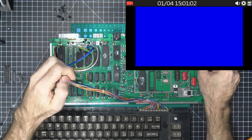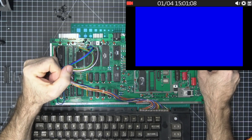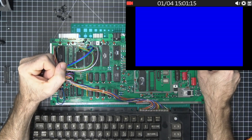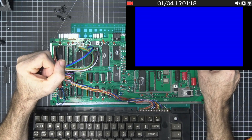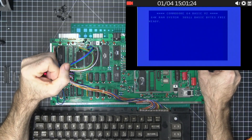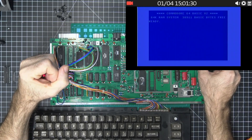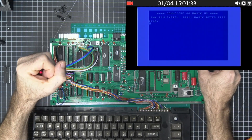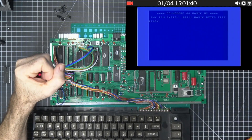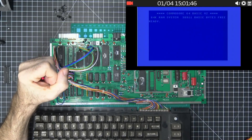So let's go ahead and fire up the C64. I'm going to hold this little LED in my hand so you can see it, because otherwise it's kind of a low-light situation. I'm going to turn this on — and you'll see it's flashing. The flashing is the PIC saying it's here; the firmware just blinks the LED a couple of times so you know the chip is actually there and doing what it's supposed to be doing. As you can see, the first thing that pops up is the original Commodore BASIC, kernel, and character — everyone's seen this screen a million times.